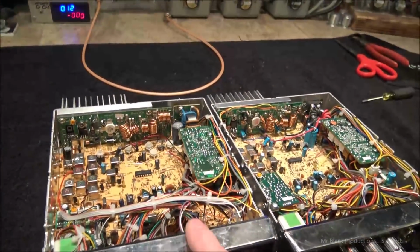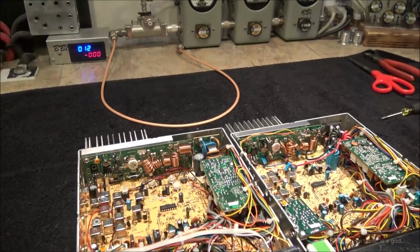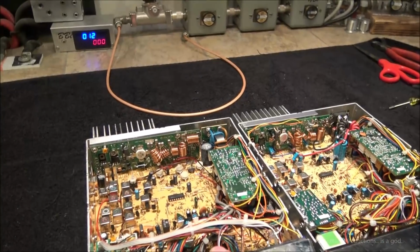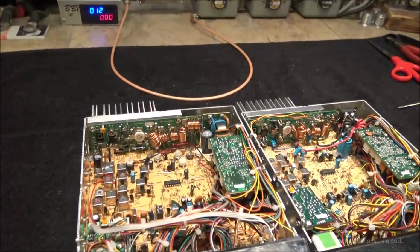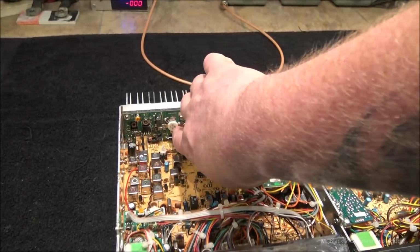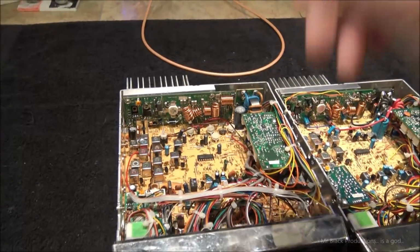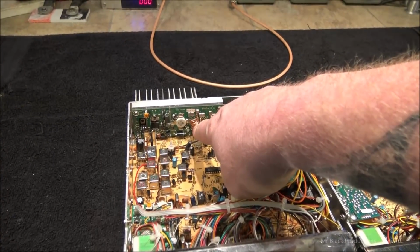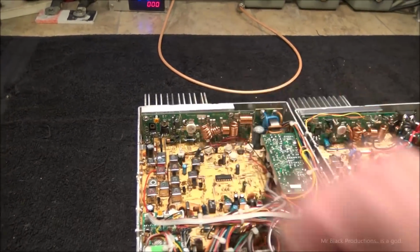Now, this is, like I said, the style of radio that we did with the 955 or the 666 radio with a 1,000-watt strap-on 4-pill that was on the bottom of it. And what I ended up doing with that one is I just simply changed the final from a 2290 to a 2879, and then I ended up having to take one turn out of this tank coil to make it resonant for frequency for the different load differentiation in the transistor.